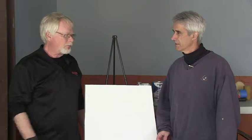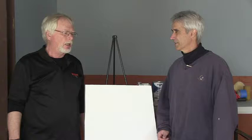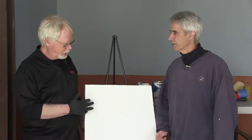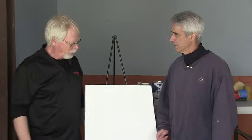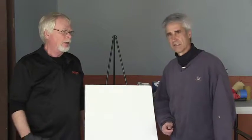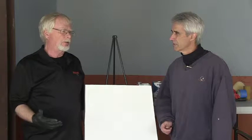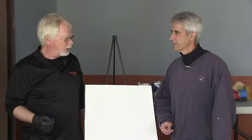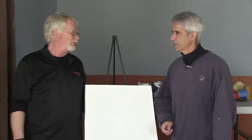With reinforced fiberglass, it becomes an option. There are a couple of times that you might elect to use it. This would be an example of a board that we wouldn't have to use the primer on. It's smooth, faired, prepped and ready for paint. But if it had some spider cracking, some shallow imperfections, things you can't put your fingernail into or fill with a compound, that's when we use the primer as a fairing paint.